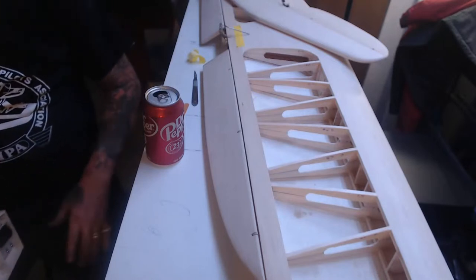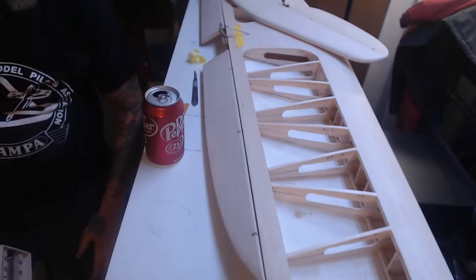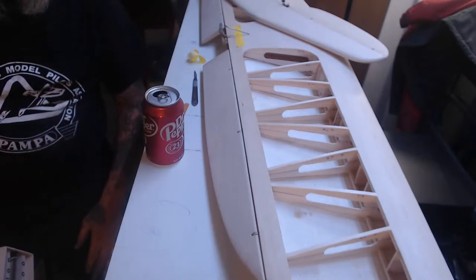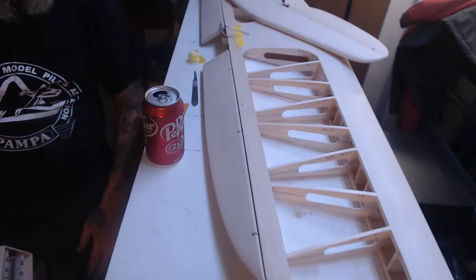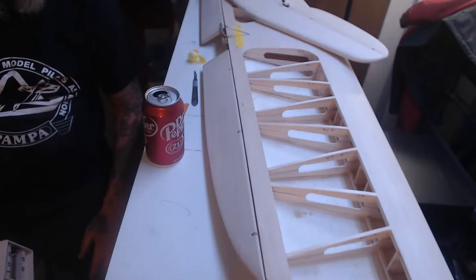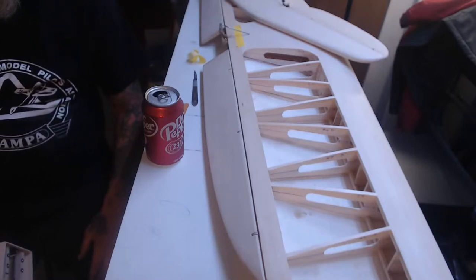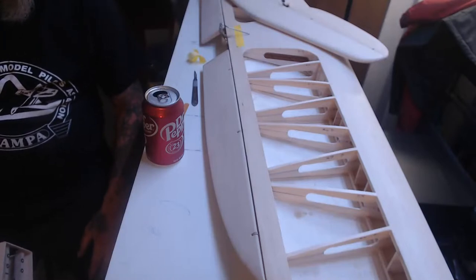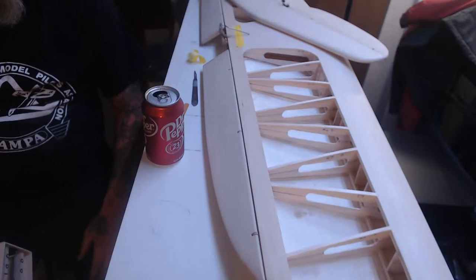All right, that's going to do it for this evening. We'll see you tomorrow night. We'll do bell crank mounting and I'll make up the bigger compression spars, and we'll mount the bell crank up maybe in an hour. So, if I can fit the bell crank, we may fit a push rod as well. And I'll show you how I'm going to zero that out. This setup is slightly different, but we'll get that done. So we get the push rod in and all that business.